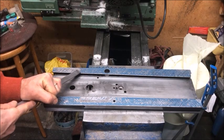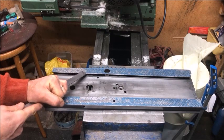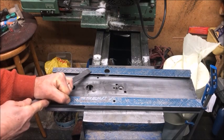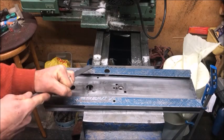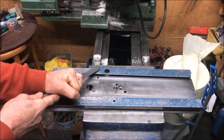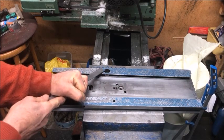For individual marks and rows, the important thing is also that you need to measure the depth of cut, so you know how deep you cut when doing machine scraping versus hand scraping, and then track the number of cycles and the scope of work. I have 19 cycles now, and this is of course hard work doing hand scraping.